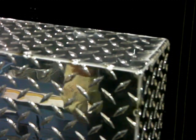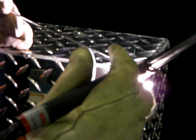We did that joint at 90 amps — outside corner joint, 90 amps — motoring along at about as fast a travel speed as I really wanted to handle and still keep up with my filler. Same joint, 90 amps, with the foot pedal floored on straight argon. I'm having to crawl; I'm having to wait for it to heat up, wait for it to get fluid. It just doesn't melt as quick, and I'm completely floored on the pedal.